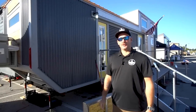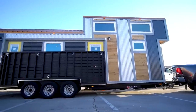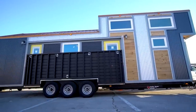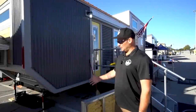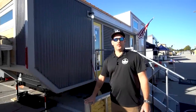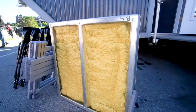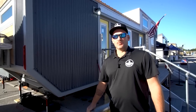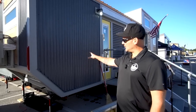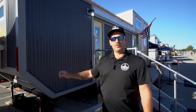The Henderson model is built on a 30-foot trailer with a two-foot extension on the back and on the front, giving an overall length of 34 feet and an overall square footage with the loft of 330 square feet. For the structure itself, we utilize cold form steel technology with 20-gauge steel studs, spray foam insulation, and ZIP board exterior plywood. Because this structure has so much steel on the outside, we put an additional half-inch insulation between the plywood and the steel for a thermal break.